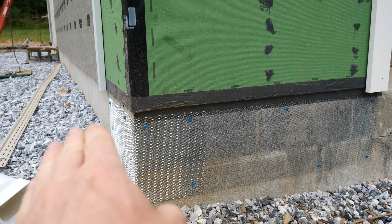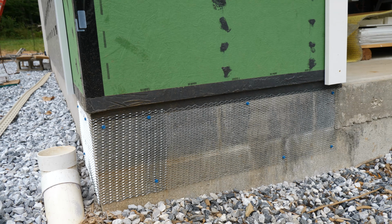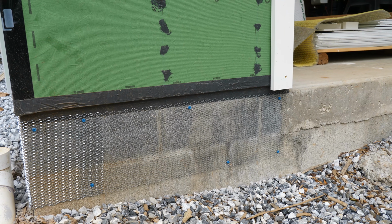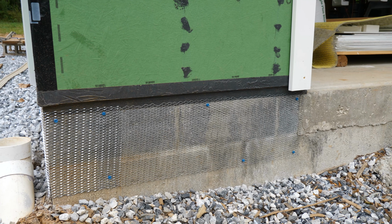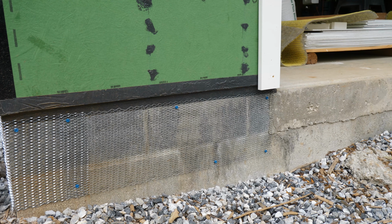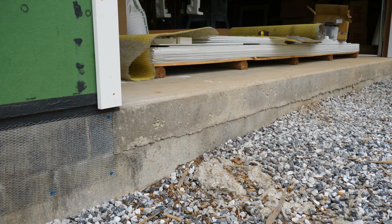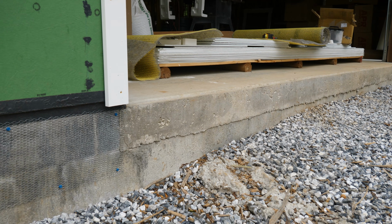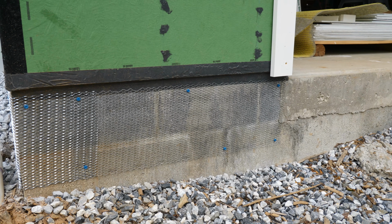That way we'll just have our normal grade. There's no need to have any stone coming right up to the lip of the foundation like you would need with the garage door. This is why a lot of builders do garages with 1 course of block up before the framing starts, but I really didn't want to do that for a number of reasons. A lot of it had to do with the radiant floor and how we were insulating the foundation. The thickness of the walls played into it, so I wanted to keep everything flat, so the slab is flat with the tops of all the block, but it does make situations like this a little bit trickier.